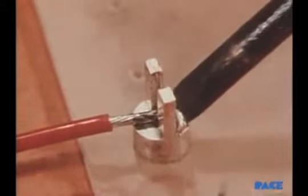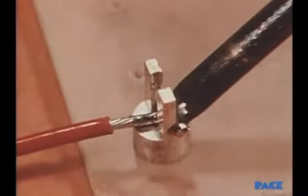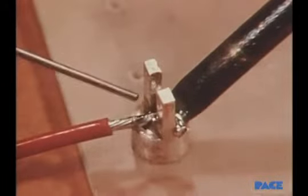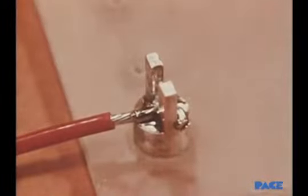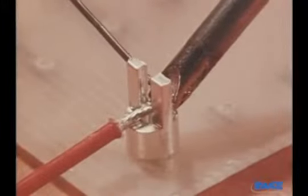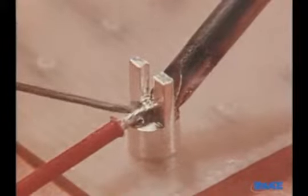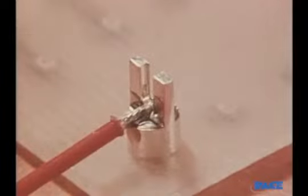Soldering is done with a large tip put on the edge of the terminal and in contact with the wire. First the solder bridge is made, and then the solder is moved over to the other side. With this type of terminal, because of its large mass, the iron can be taken off before the solder is. The iron should be removed when the solder is flowing and there is enough heat for a moment to complete the joint.